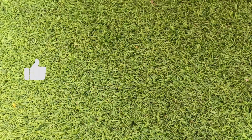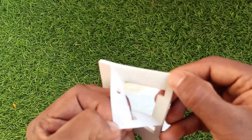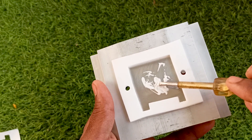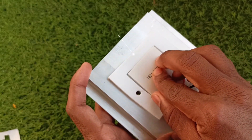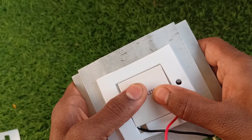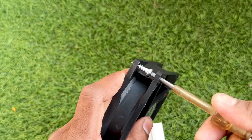To get started, take a big heat sink and stick the insulation gasket on it. This acts as an insulation gasket and also protects the Peltier from pressure — it's just like a foam. Take some thermal grease and apply a small amount on it; this will increase the thermal flow from the Peltier. Press the Peltier firmly on it — remember the cold side is labeled by the model name on the Peltier — so stick the hotter side to the heat sink. Then fix the CPU fan to the heat sink: the faster you remove the heat, the cooler it gets on the other side.